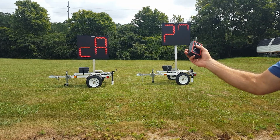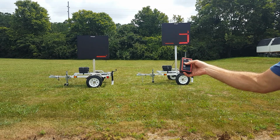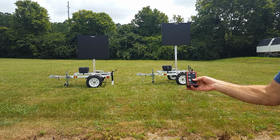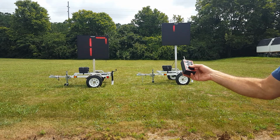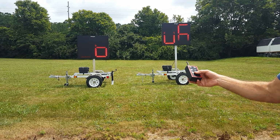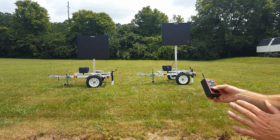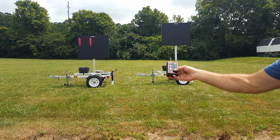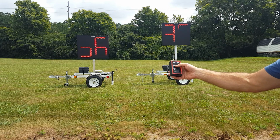This is a 900 megahertz wireless radio. It's 250 milliwatt power. Its range, we test before it leaves the factory, for 1,500 feet. We send someone out 1,500 feet and test each one for synchronization. If you do lose the antenna, or the data is interrupted, they continue to count down, and that is the controller beeping to give you an indication. So you just hit 40 again, and they're off and running again.